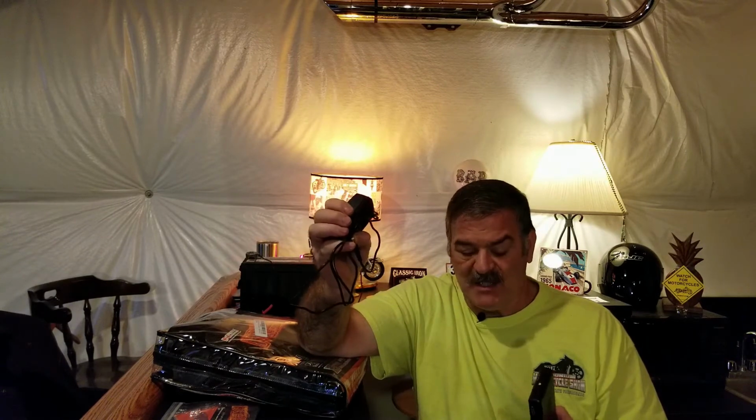You may have different amperage battery packs, you may have different amperage chargers, and 5 years from now, you might not quite remember what goes with what. So put some kind of mark on it. Put some heat shrink on the cable and write something on it, just something to help you remember.